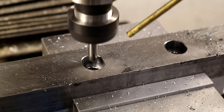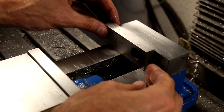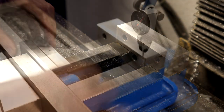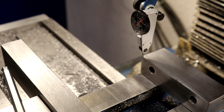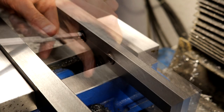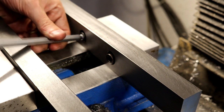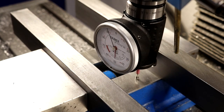Ideally the new jaw plates would be squared up but it wasn't practical with the tools that I had. I could use the new jaw plates to bootstrap and make nicer ones, but until then I'll live with the surfaces being a little rough. It's not going to matter much though because the step is going to be milled in, and that will be the surface that parts will be clamped against.